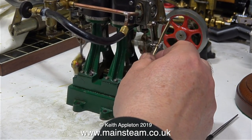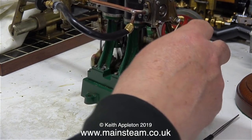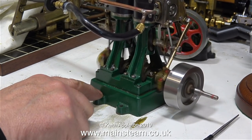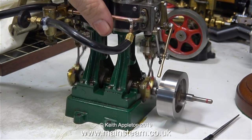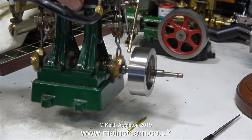What I'm doing at the moment is notching up the engine, moving the lever back towards reverse, and this is a good sign that the engine is OK if it still runs when it's well notched up. In my videos steam engines always sound a lot worse than they are, because when I lift it off the soundboard it's entirely different.